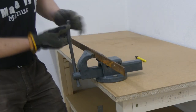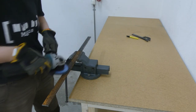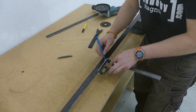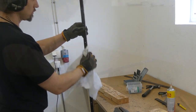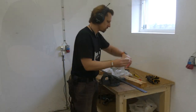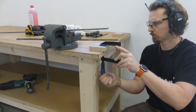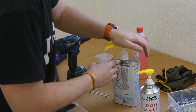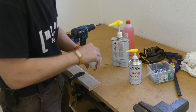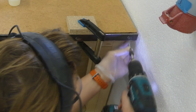To protect the edges, I decided to use some pieces of flat iron that I had laying around. After cutting it to length, I used my angle grinder to remove most of the rust, marked out the center line, and center-punched for the screw holes. All the holes were then countersunk. After deburring and cleaning with some alcohol, I did a dry fit and pre-drilling. I mixed up some epoxy to use in combination with the screws, added it to the bar, held it in place, and added the screws.